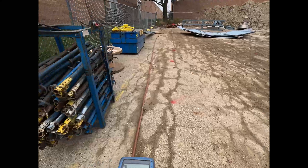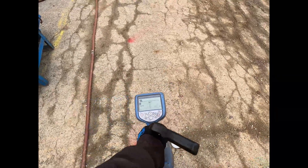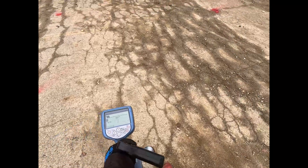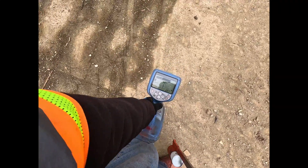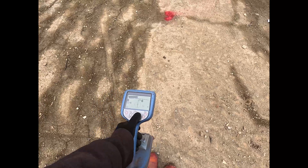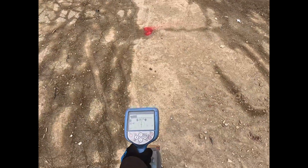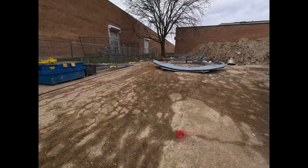You can see this dot here — nothing's moving. My gain is going to get 78, which it sits already, not too high. So this is my live line right here, folks. On the other transformer I was reading 2.25, and here I'm reading 2.61 at about 2 feet depth, the other transformer reading a little over 2 feet as well. I'm getting a good response on peak and null — my dot's the peak and you can see my null right here. So I know this is my target, and the other line over there is the Comcast line that I bled onto.